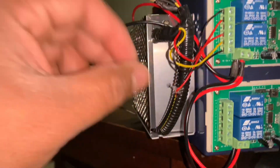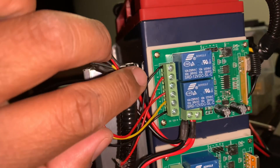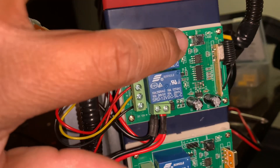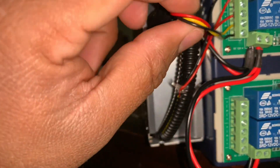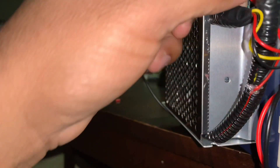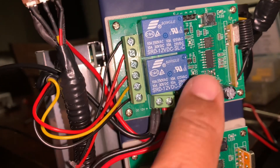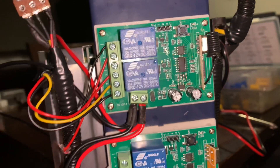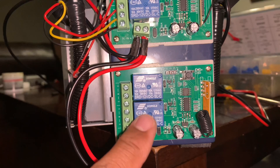These wireless relays come with instructions on how to wire them. The top relay controls on/off using the black and red wires. The bottom relay is normally closed for forward, and when activated it switches to reverse — it connects to the wires for the pulse width modulator's forward/reverse switch. For steering, I wired a steering motor left and right using these two relays, which come with a diagram for wiring to an electric motor.